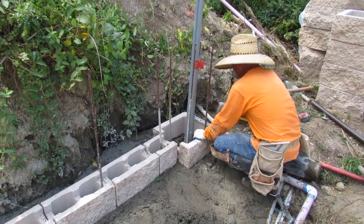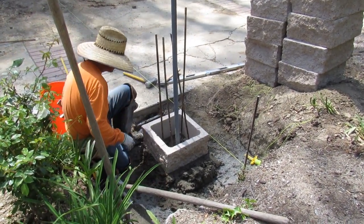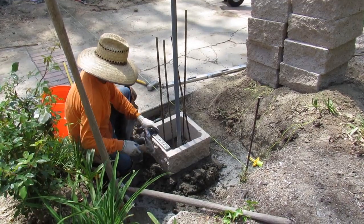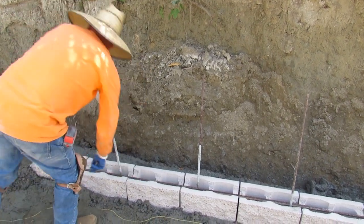They're going to have LED lights on top, so we ran the electrical conduit for them across the driveway to the other pilaster and stuck it out the pilaster. You just have to make sure it's dead center of the pilaster so when they put the light on top it's centered. We ran number fours inside the wall too.